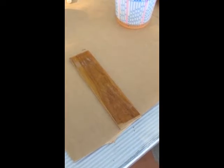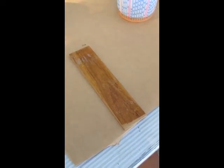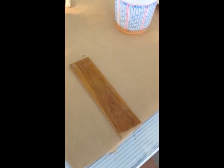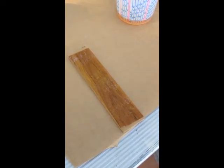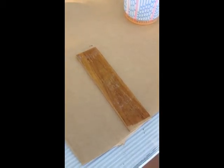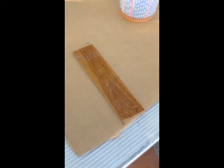the bare wood when you're on bare wood, and the air bubbles, and that you're gonna get those. It's almost inevitable that you're gonna get the air pockets that are gonna gas up out of the grain. Are we worried about those bubbles in the long run? No. They'll work their way out eventually, and most of the time they will fill in with your subsequent coats. And if they don't, then you can just scuff it back down and continue on with your coats.